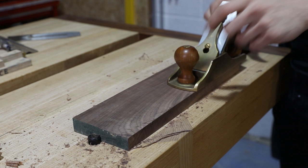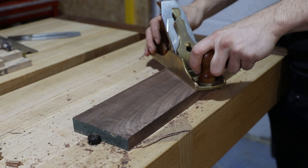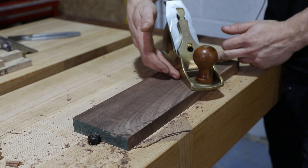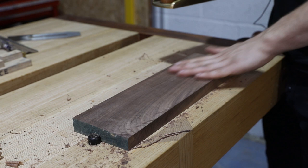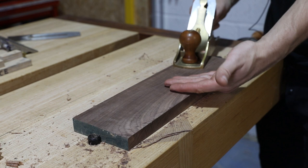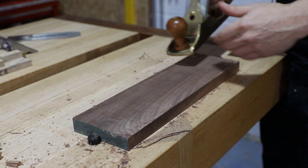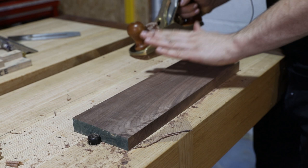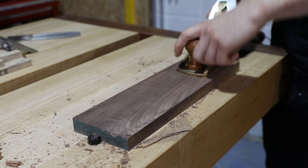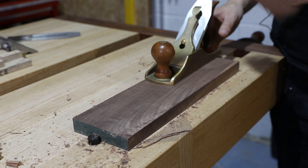So there are advantages and disadvantages to skewing. The other thing it does is shorten the effective length of the sole — if the plane is going straight on, you've got a long sole to reference off and it's more likely to make the board flat. Whereas if you skew it, it'll follow more of the contours and won't be as flat. But if you don't need this surface to be perfectly flat and just want to clean it up, skew it, let it follow those bumps, and you'll get a nicely planed surface. If it's tearing out horribly, it might be because you're skewing too much, or you need to sharpen a steeper angle on your blade or increase the pitch of the frog — all detailed in my video on how to reduce tear out, link is in the description.